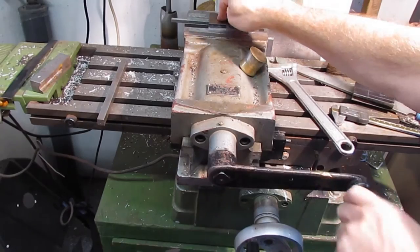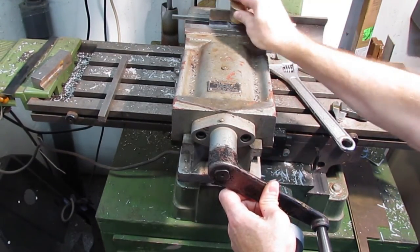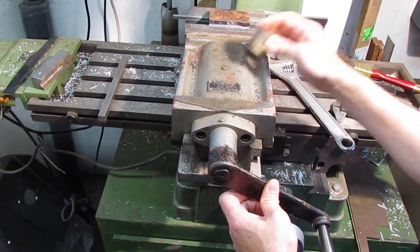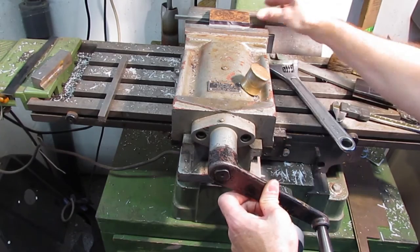In order to ensure the parts are tight against the parallels, a hammer or bump block is used to tap down the parts. Another option is to use paper feelers in each corner. My vise isn't perfect, so the blocks barely get tight in the parallels.